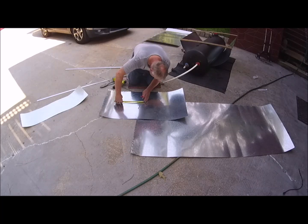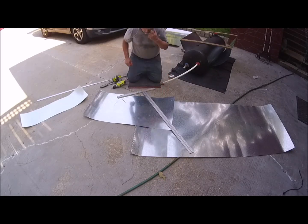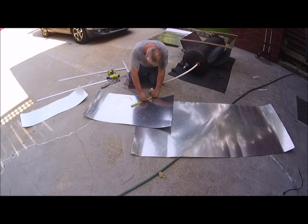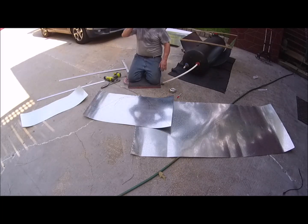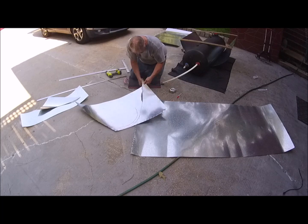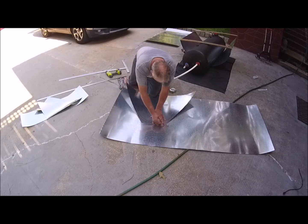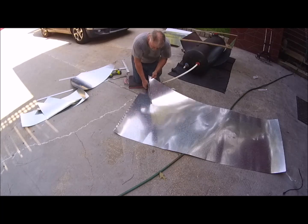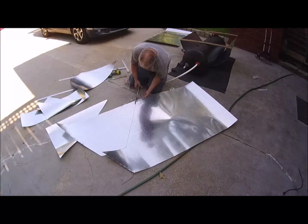This is a parabolic trough mirror, and I'll put a piece of glass on the top of the trough. Right here I'm calculating the angle and marking the circle on the bottom for the water heater to sit in, then cutting that out. I'll have a one-inch lip around the bottom and sides. Unfortunately my battery died before I finished that part.